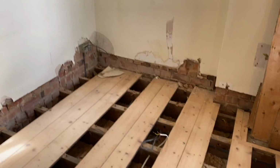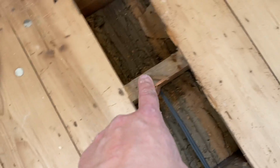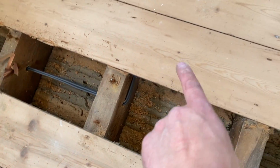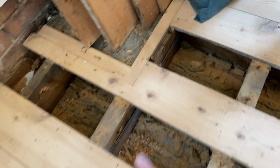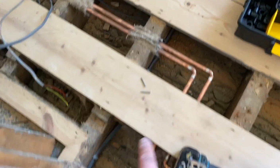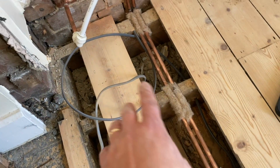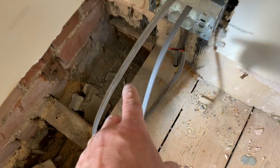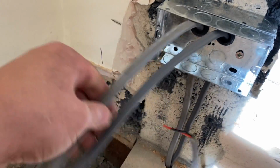Okie doke. So, new socket cables feeding. A lot of you like to see the cable work underneath, so just keep it neat, nicely clipped. That's going to be a Wago box, picks up the corridor socket, okay? Clipped along. This is now, I thought I'm not going to have another cut in, so he's there. Picks up those two. James drilled me some holes. Original cable comes up, and then cheers, Ashley. Runs up and picks up the socket there.